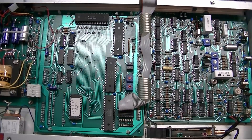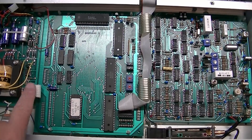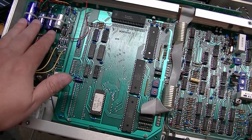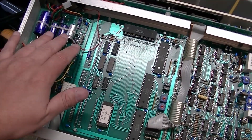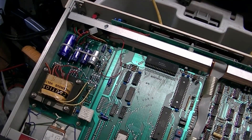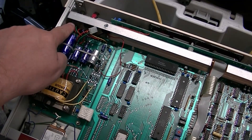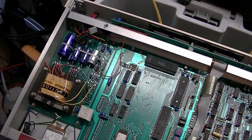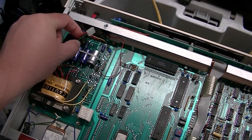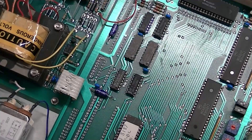Today in the lab we are doing more work on our Kinemetrix 468 DC satellite-controlled clock. I'm going to replace the flex unit between the power supply and the main board, see what we can do about these capacitors, and I've already removed the counterfeit L7805 CVs from the last Kinemetrix episode, replacing with a single LM7805 from Fairchild tested good up to 1.5 amps. The second regulator on this plug isn't actually needed since it just gives more five volts out of that port.